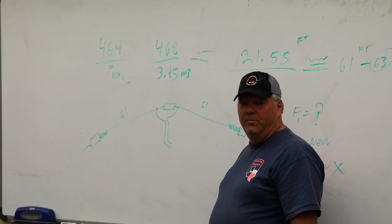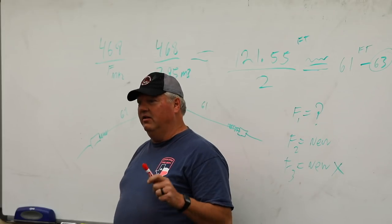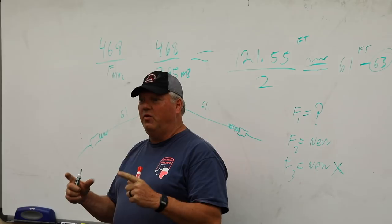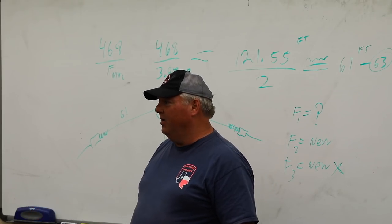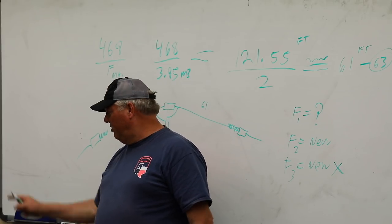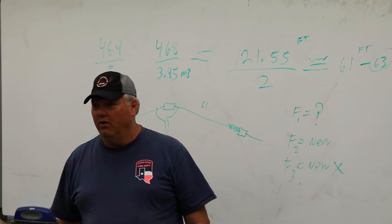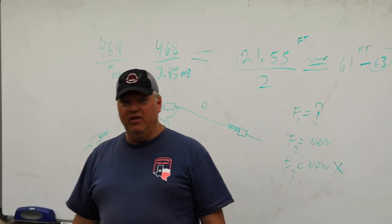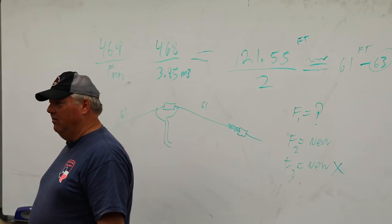Barbed wire, what about barbed wire? I actually tried it. I went over to Pacific Hardware and thought, wow, electric fence wire, wouldn't that be awesome? About 5,000 feet, right? I put up a 1,000-foot loop, hooked it up to my MFJ and went, holy cow, it's 50 ohms. I got stupid lucky and it's flat. I thought this was going to work great. I hooked my transmitter up and it loaded up great.